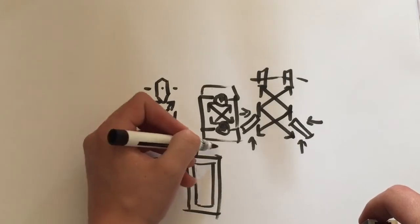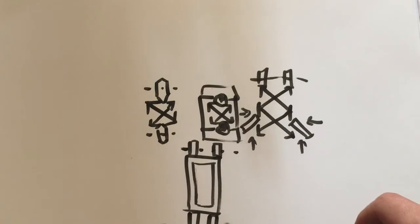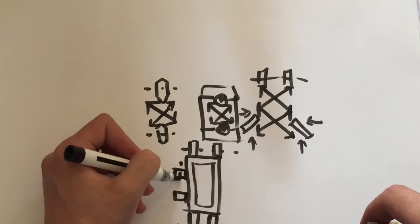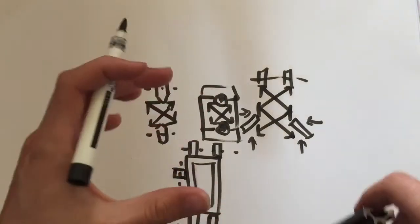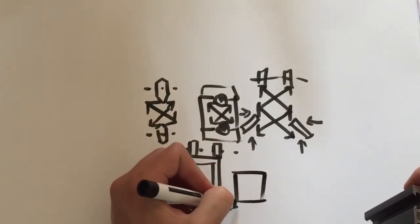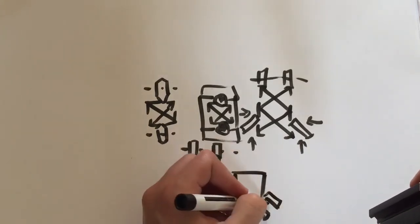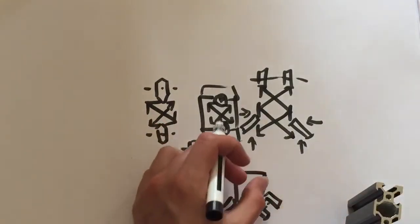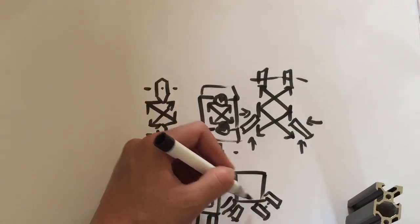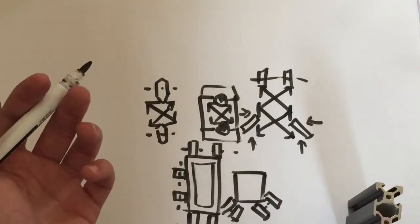What I would suggest is using wheels or bearings like so. But yeah, use bearings there along axes like this, and probably some retainer bearings on either the outside or the inside like so, just to box it in. Now I have seen one system that uses a pair of bearings like so on the corners and just a washer in between to distance them, and then kind of squeezes those across there. However, I don't feel this is very secure because you've only got the corner here impacting on a flat surface and it just doesn't feel rigid enough, but that is another solution.